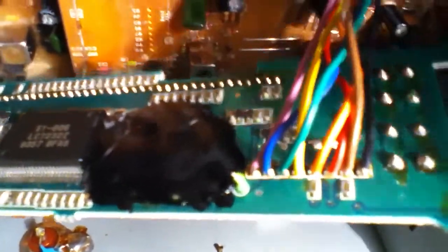Another thing: just cut the meter wires — it's just a positive and negative — and that makes things a little easier. Now we have access to the front panel. Those three solder joints right there, I believe, are the back side of the pin header on the old board, and they covered it in epoxy. But I think I can cut through the epoxy, un-jumper it, and then put a jumper on the front for the open frequencies.